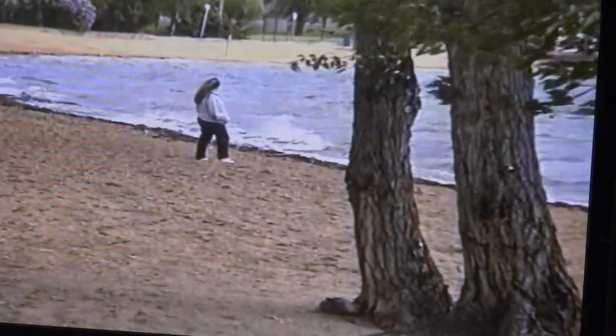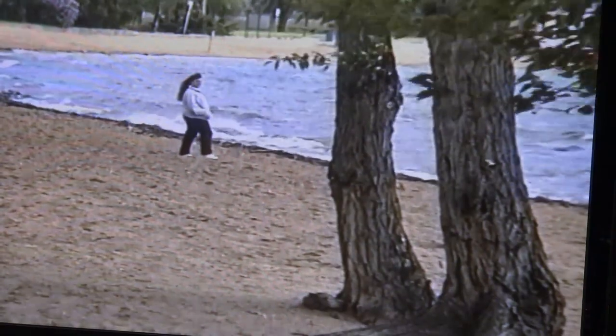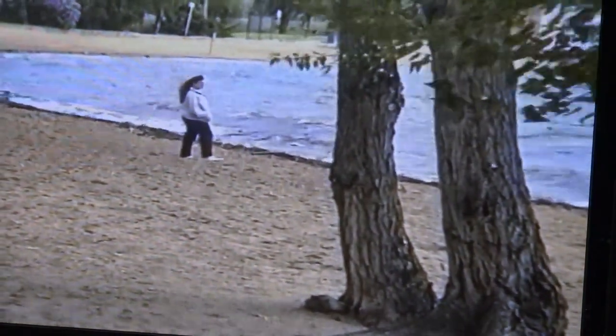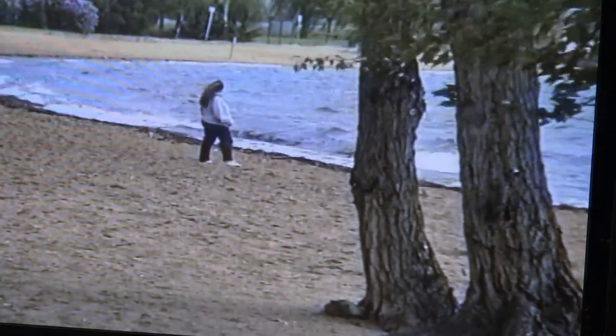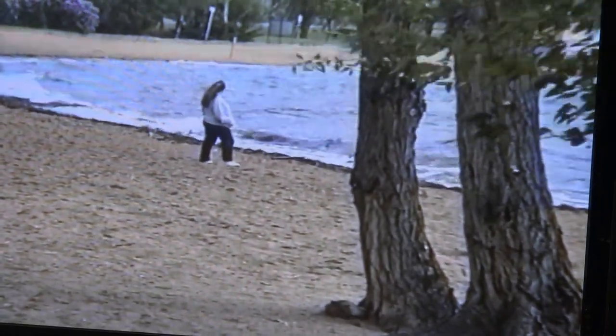So this is the biggest problem with all these older 8mm Hi8 and evaporated tapes. And I don't think digital 8 tapes are immune to this either. The tapes themselves, when they get to be 20, 25 years old, they're all starting to fail. And you get these glitches. Now sometimes the glitch is just a glitch like that. Other times it'll clog the heads and your recording is ruined when you're trying to transfer it over.